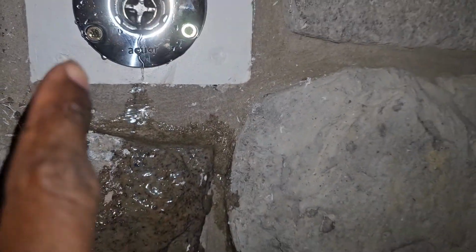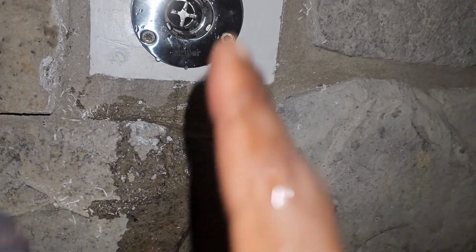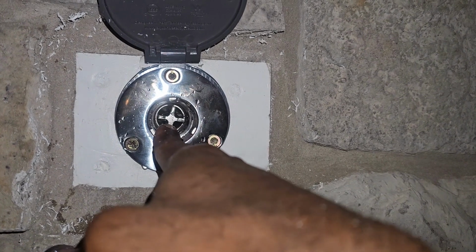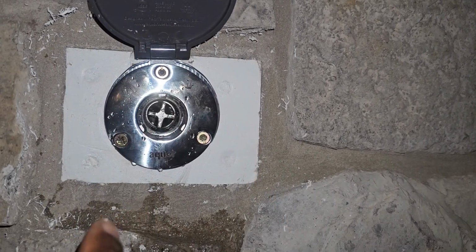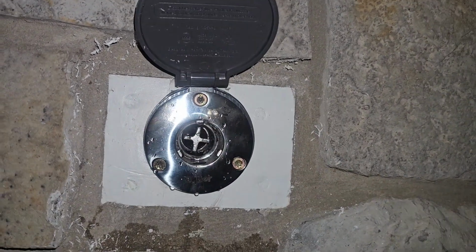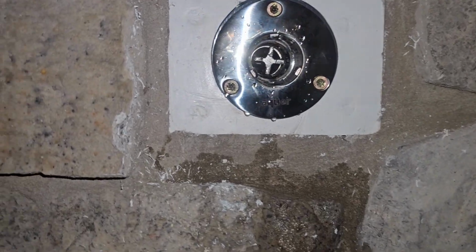I mean, just disengage it, water drains out, and you're golden. So that immediately makes me think, if that spring breaks, this is how you find out this doesn't work or it's broken. The spring holds this in place. If that spring breaks, you're gonna have water gushing out of this. That's the first sign that your system or your piece is malfunctioning. So you can hit them up, go like, hey, the piece that you gave me doesn't work. Let's find another way. You can ask them for a new spring or ask them for a new unit. I believe they can meet you either way. But yes, finally installed and it's working fine.